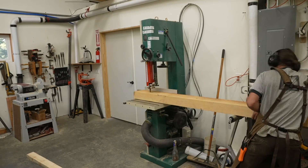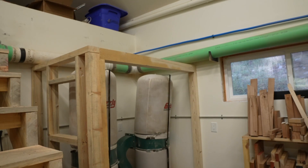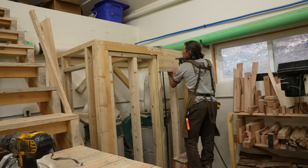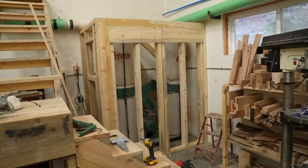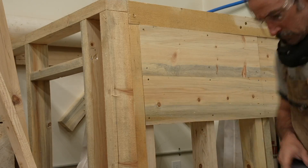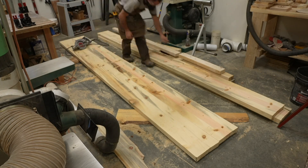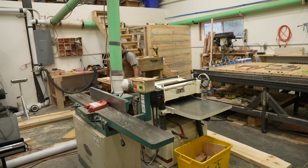I spent about half a day milling wood and produced actual 2x4s and some actual 4x4s. Some of my lumber I had to resaw a bit to get down to the dimensions that I wanted. As I was starting to build the walls, I realized I could make the top strong enough to walk on and also gain some extra storage. The doors are simply framed inset about an eighth of an inch on each side. I planed some of my one inch rough lumber down to three quarters of an inch and used that for the outside of the doors. For the ceiling and roof, I milled some two inch rough lumber to about ten inches wide. The amount of planing I did for this project filled up two entire bags of dust and chips.